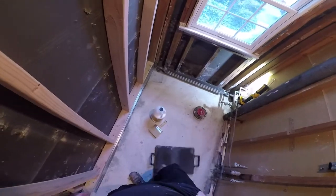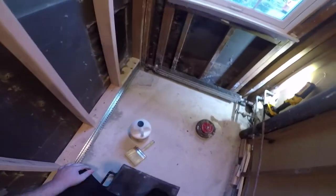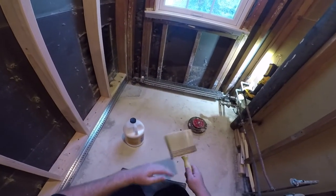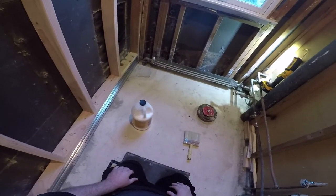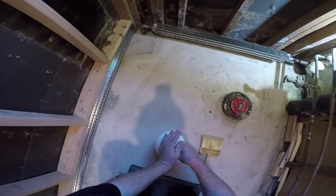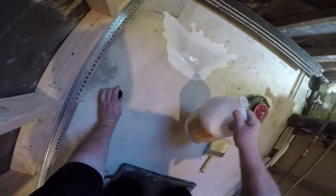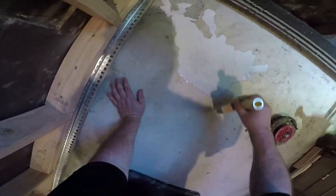All right, so my next step, I gotta prime the floor with the Sika primer concrete bonding agent. Let's do it. All right, time for the glue before we make it true. Just get yourself a donkey brush, throwaway cheapy, big one. You can use a roller for this, but using a brush will apply it better, unless you're doing multiple coats. I'm looking to do one here. Yep, run to the corner.